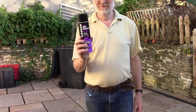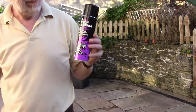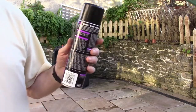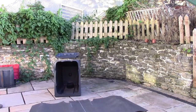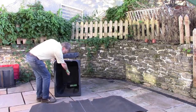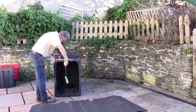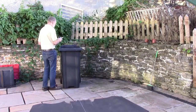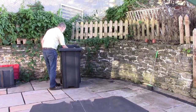It's difficult to get a perfect fit. The next stage is to stick it. I'm using a flooring adhesive - it's an impact adhesive. So in theory you spray it, let it dry for five minutes and then put it into exactly the right position. In my case you can't fit it exactly so I'm not giving it as long to dry, but nevertheless it does seem to have worked okay. Cleaning out the inside of the bin to get rid of dust and rubbish. I'm spraying just one face at the moment as the initial fit.